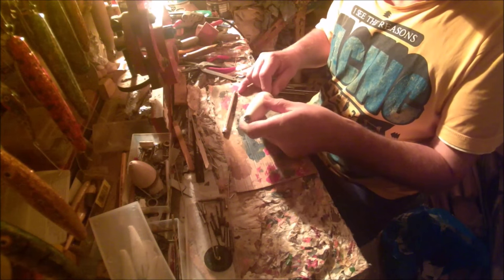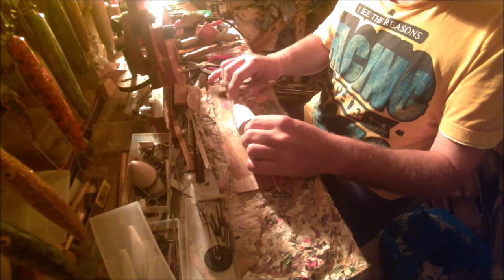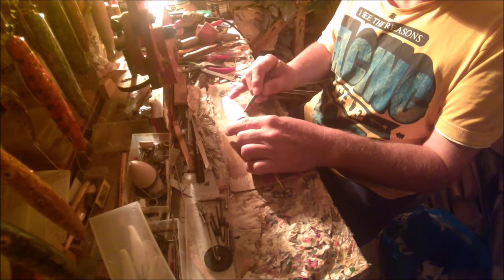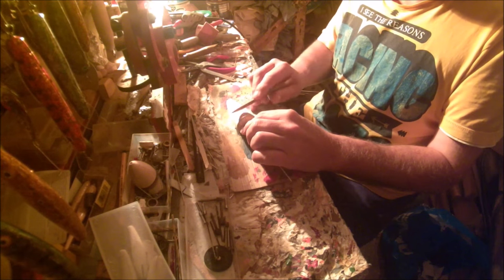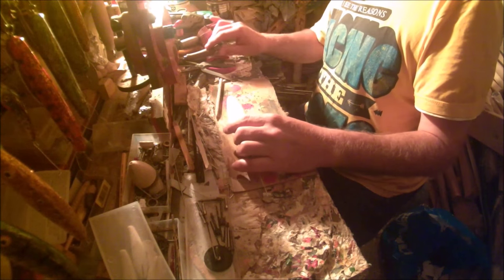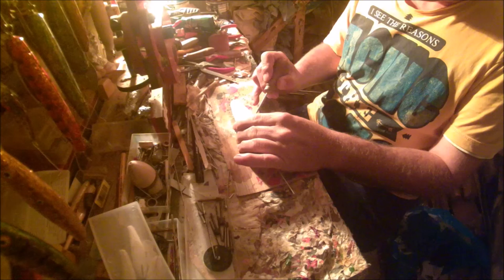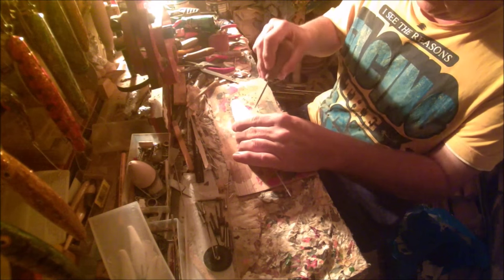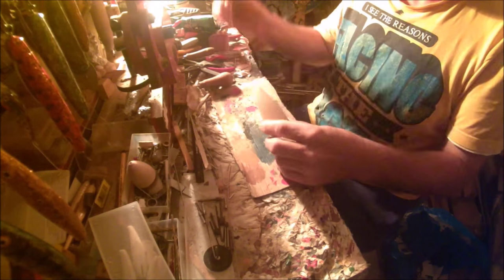Okay, after the seat of the rear hook hanger eye has been completed, I'm going to mark the location of the belly hook eye, which I will make here. And make sure you let that hole run crosswise to the wood grain. All right. Now make an indention with the awl for the pilot hole of the belly hook hanger crosswise to the wood grain. Here's the indention now.